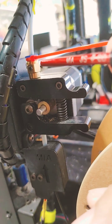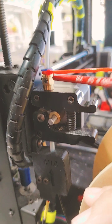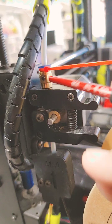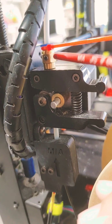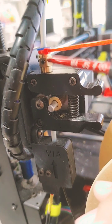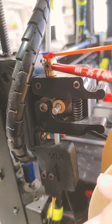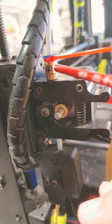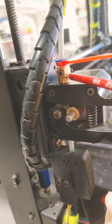They don't hold this Teflon tube really well. So in my particular case I didn't have spares, and so I decided to just drill three holes here because this is a hex head. At 120 degrees I drilled three little holes and I tapped them — I do have taps. You've got to have taps to thread these things to that size screw. So I tapped these.